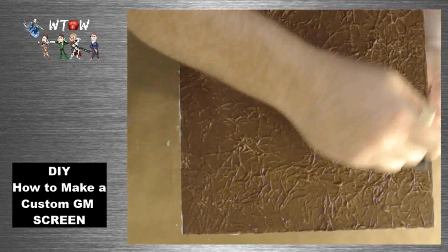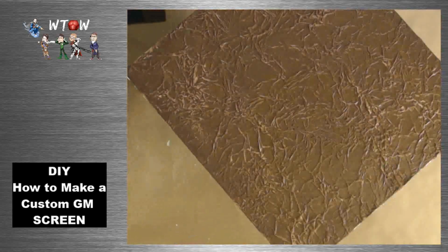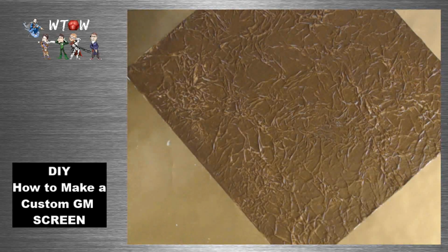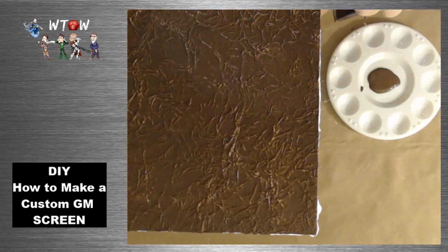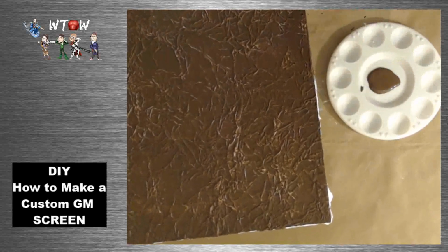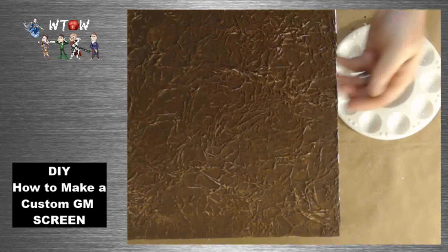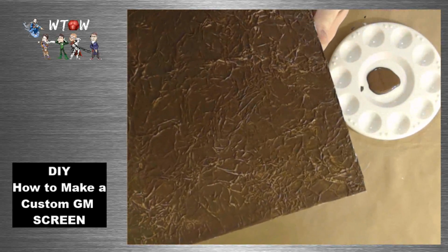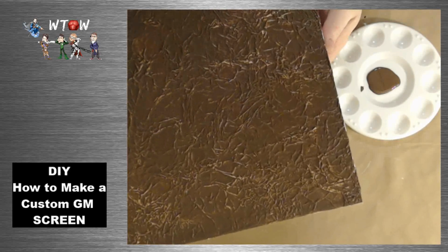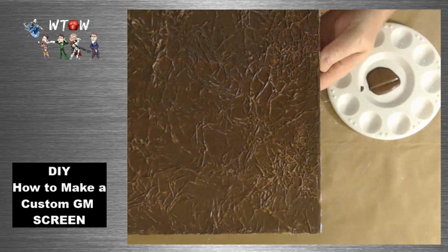And now that I'm in using that brown paint, you can start to see that texture starting to pop out a lot. Here at the end of each panel, I'm doing each side and each edge, but here at the end of each panel, what I did is, without any additional paint sitting on that brush, I came back and took that brush over the top of the entire project going just one direction. And what I found that did is it thinned out a few spots to create a little bit more aged look. It highlighted some of that ridging and texturing that you see across the panels. And I'm going to do this for each panel.